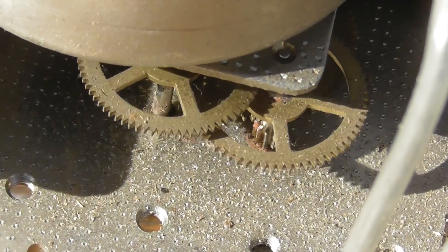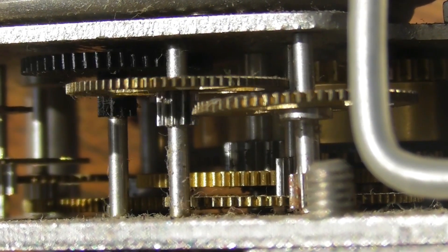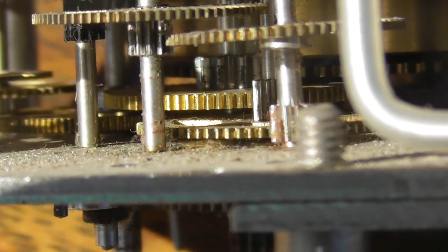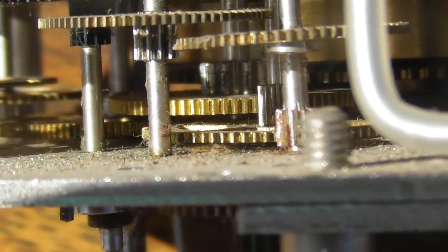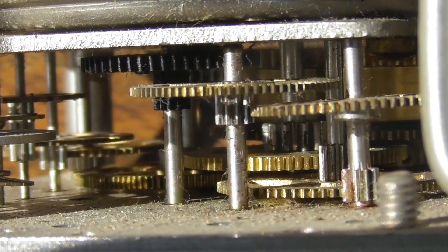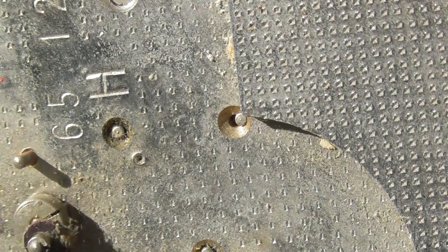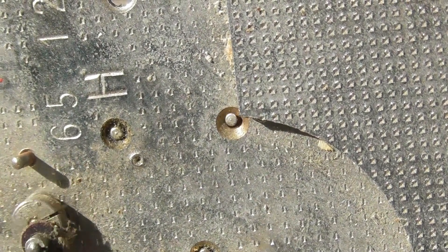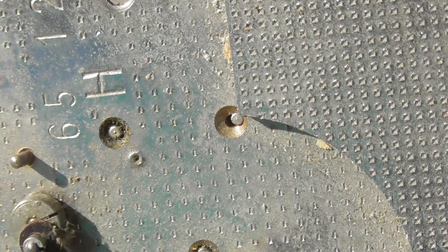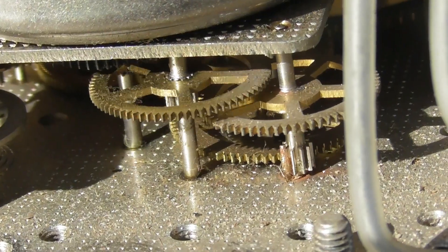Let's have a look and investigate. As you can see, the first black wheel is driving the second wheel — it's happy. The third wheel is slipping. If you look at the shaft, it's under a big angle — it's not happy and I can see why. It's missing the drive here. There's too much end play. You can see the movement here in the bush — this needs to be re-bushed, drilled out and a new bushing inserted. This is a spare mechanism from a stripped clock, so I'm not going to repair it, but I'll keep it for spare parts.